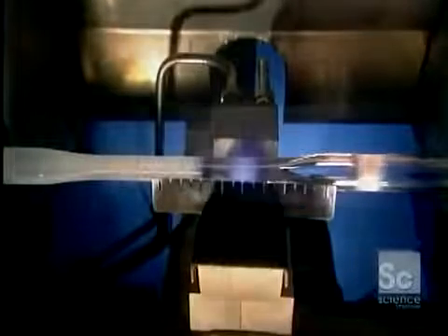When there's enough fused soot, they turn up the heat until the soot itself turns into glass. Then they heat the glass tube enough to soften it and to soften the new glass inside. The intense heat eventually makes the tube collapse on itself to form a solid rod. The internal structure of the optical fiber has been achieved, but it's in the form of a big bulky rod called a preform.